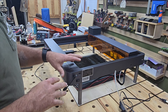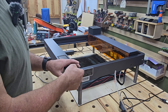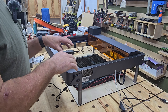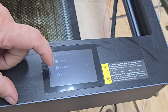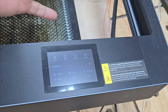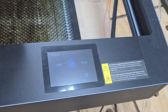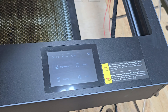One of the things I love about this machine is you can print on it however you like. You can put G-code right onto an SD card, pop it in the side of the machine, and use the onboard touchscreen to run your files — no dedicated computer connected to the laser required. Right from the home screen, you just hit carving, it reads what files are on your card, you pick a file, hit carving, and the machine starts. To set up your material, you go to adjust, hit 1, and that turns the laser on to 1% so you can move the head to where you need it. Real great features.